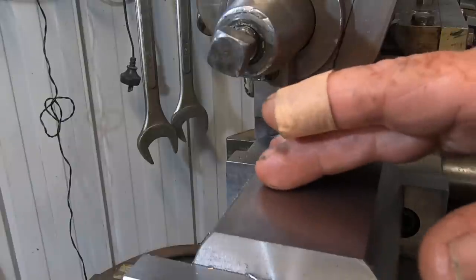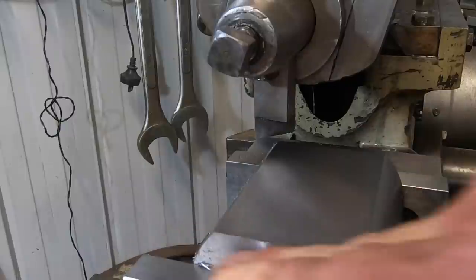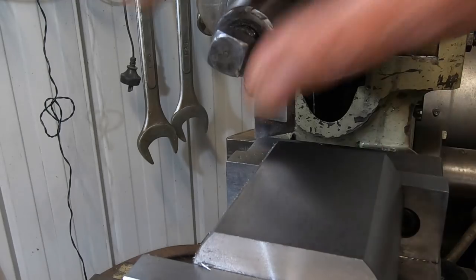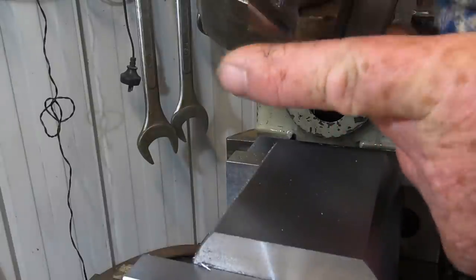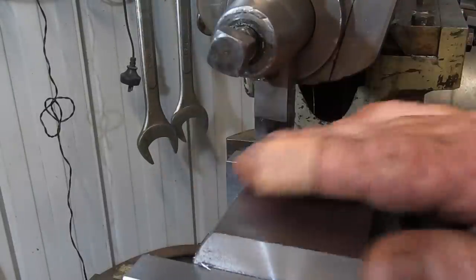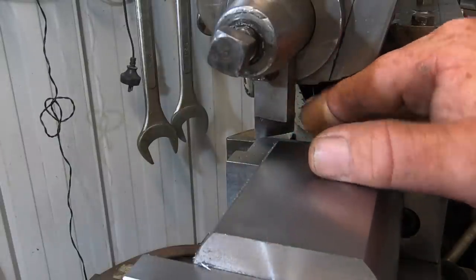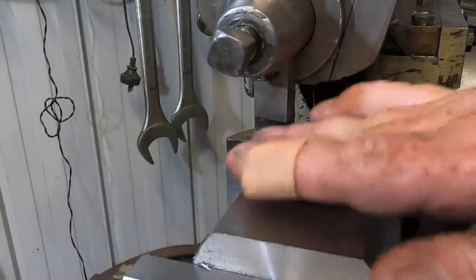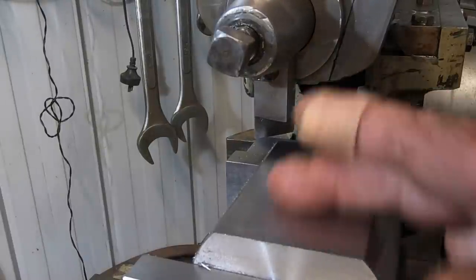That was a nice finish, good reflection off it. That was a 3 thou cut. That's about the top end of what depth of cut I'd like on a shear tool. I don't like taking any more than, say, no more than 4 at the most. So the 3's about the limit, I reckon, my opinion anyway. But it's a super nice finish, like I can see the reflection there. Nice. Measure it up and see how close I got.